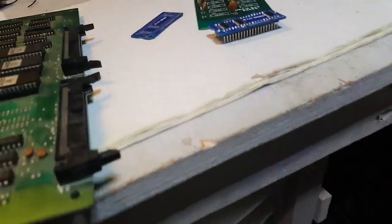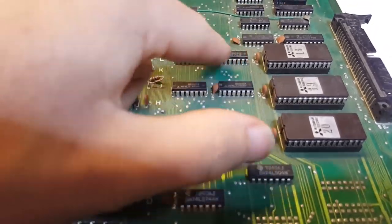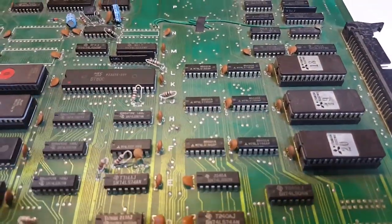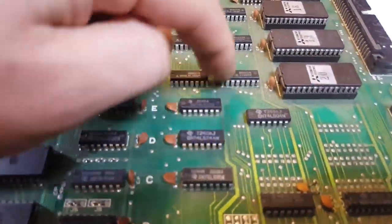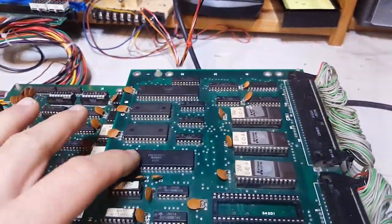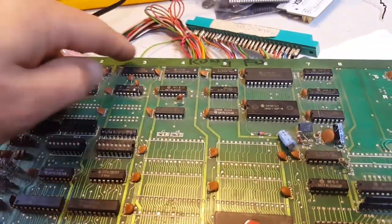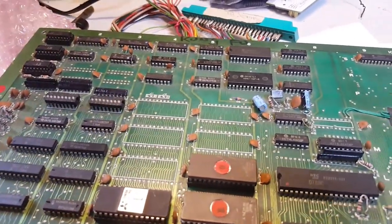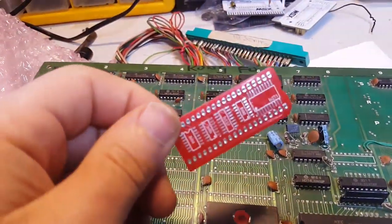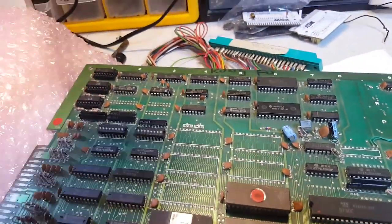And the bootleg board is once again handy because, if you look here, this 6166 is essentially the 166 that you find on the subboard. So this is the reproduction of the custom. In fact, if we look around, this guy, for instance, is reproduced by all these chips here. So I have been working on making a repro of this one as well, and this is the first prototype PCB I've got, so I need to test that first and see that everything works fine.